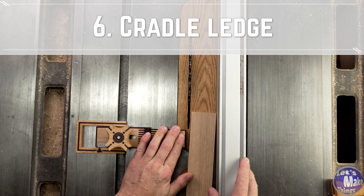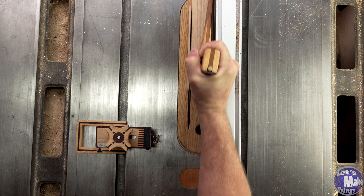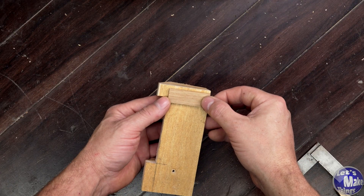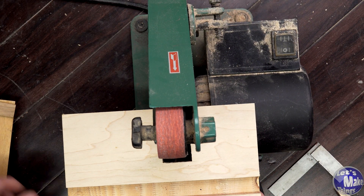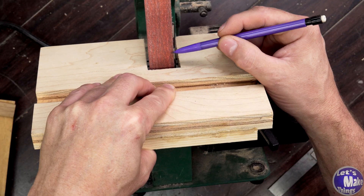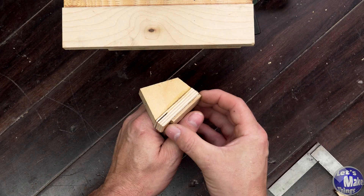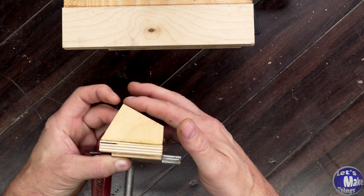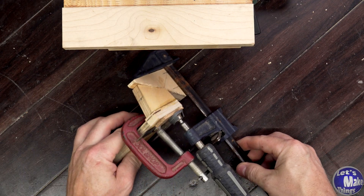To create the ledge that our blade will slide up against, I'm going to use a piece of solid stock, and I need to cut off about an eighth of an inch. I've got my thin strip jig here and I'm going to do that now. I'm just going to cut this off at about two inches, maybe a little bit less. To attach your ledge, it obviously needs to be exactly 90 degrees with the blade — otherwise you're going to have a skew, and you don't want that. You also want to make sure that when you attach your fence, the belt is as close to it as possible. With mine, the belt is just slightly over — I want to make sure the belt is right over that ledge. I found that right about here is going to work out. To make sure that I'm at 90 degrees, I'm going to add my square, clamping it down. We'll give this some time to dry and come back to it.